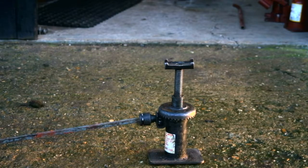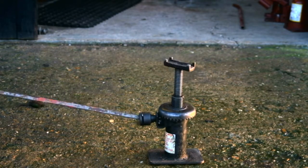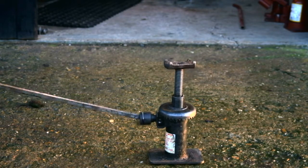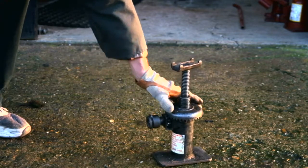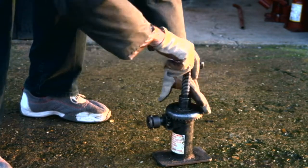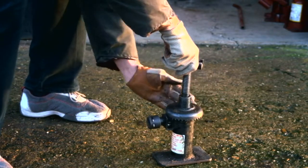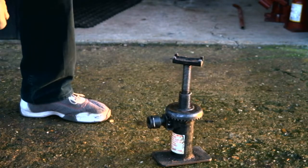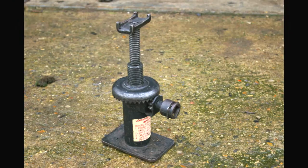A bigger drawback is how to set the jack. If you merely put the handle in and turn it, the whole mechanism turns and the jack doesn't raise at all. It is in fact a two-handed operation: with one hand you've got to hold the shoe and with the other hand you've got to turn the screw at the bottom. And of course you're going to be doing this in the field, lying in the road, maybe snowing, maybe driving rain. You have to wind it up manually until the jack's in contact with the axle when you can then use the handle. As an engineer, I rather like this jack — it's simple, there's nothing to go wrong with it, and it does the job. It's also fairly lightweight. But it does have a couple of practical drawbacks, and I decided on balance to try and find a good hydraulic telescopic jack instead.